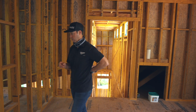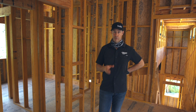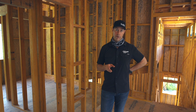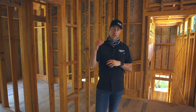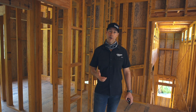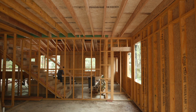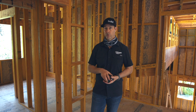A couple of downsides for the framers themselves: these studs are heavier, so there's additional wear and tear on the crew as they're framing. You also have to be careful about pre-cuts — typically when we buy framing lumber it's pre-cut so the crew can go right off the stack for 8-, 9-, or 10-foot walls. With LVL studs you often won't find pre-cuts — you'll get them in 20-foot lengths and have to plan your cuts. For this house we got 20-footers, cut them down for nine-foot ceilings, and saved every offcut for outrigger details and other uses. Those are precious — we didn't throw them in the dumpster.